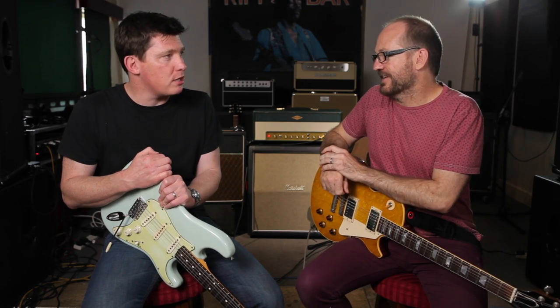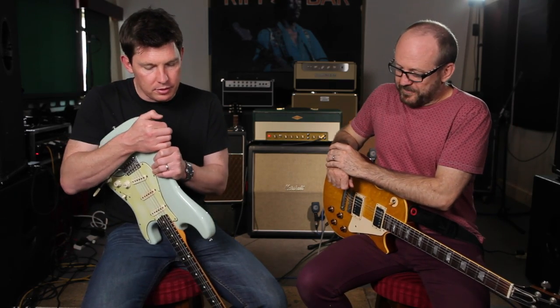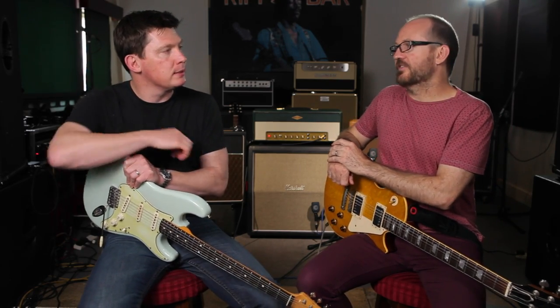What voltage does it run at? It runs at 12 volts DC. And it takes about half an amp. What about the tubes? What voltage do the tubes run at? It's high volts. They're running at hundreds of volts DC. Okay. So it's a proper tube pedal. It's not one of the pretend tube valves that have LEDs glowing underneath them to make you think that it's on. It's a proper one.